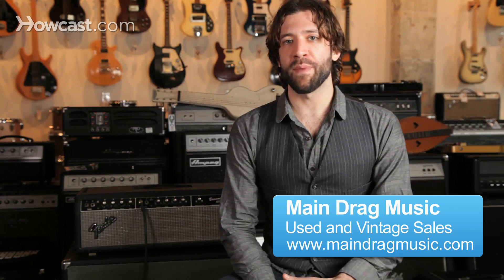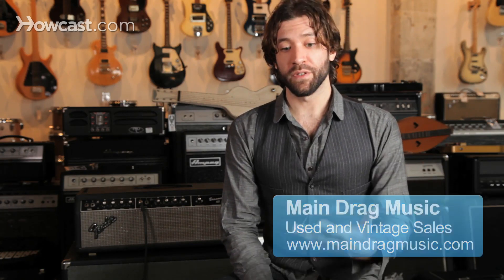I'm going to briefly describe the differences between passive electronics and active electronics. I'm going to show you these examples on basses — it can be applied to guitars, it's the same principle. Typically you'd find an active system on an acoustic guitar or acoustic-electric guitar. It just means there's a preamp built into it, a whole circuit dedicated to the preamp. It requires a battery. If you put that into an electric guitar or bass, you're going to be dealing with higher output pickups because now you have an actual onboard system powering those pickups.